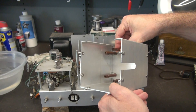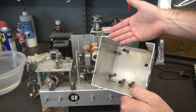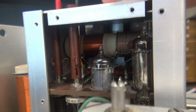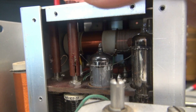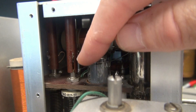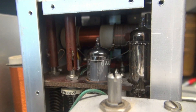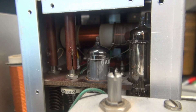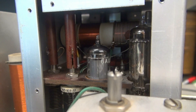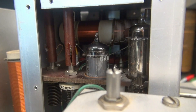What I do is glue these in place — just put a little dab of adhesive on there so that when I go to put the cover back on, they won't fall and cause trouble. As you're lowering the cover down onto the VFO assembly, watch these rods and make sure those springs are dropping into the slots on the capacitors. You can slightly turn these and feel if they're engaged. That'll make this a whole lot easier to put together and reduce the chances of knocking those springs out of their shafts.